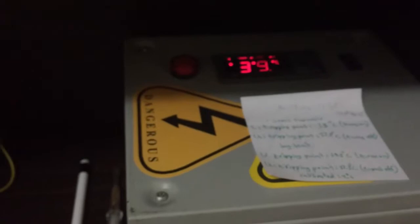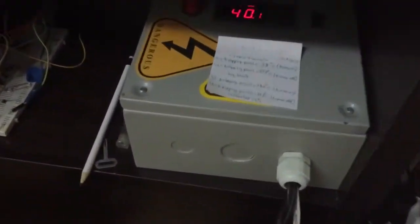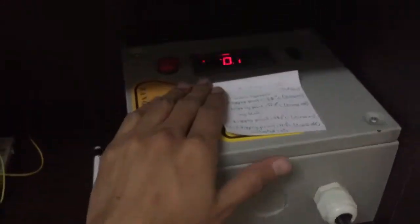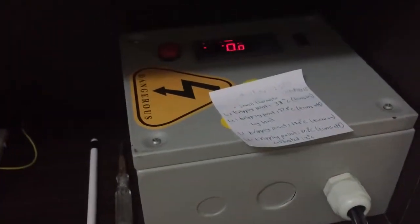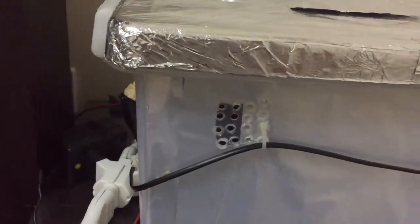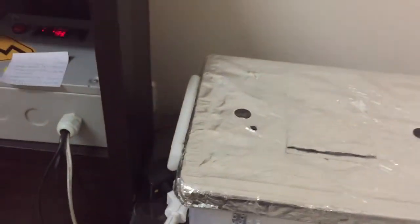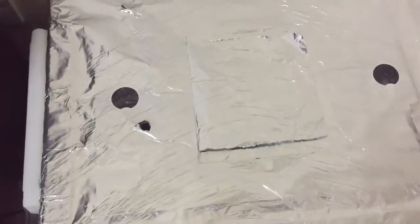The display doesn't actually look like that because I'm filming at 60 frames per second, so there might be a frequency difference. This is all the information of this incubator — this is the control unit. The incubator trips, meaning it turns off, at 40.1 degrees. The temperature right now inside is 37.5 and it trips back on after one degree difference. These are a bunch of poles and this is the wire going from the bulb to the thermostat — it's a water heater thermostat — and this is the wire of a sensor that's inside. The bulb is off right now.